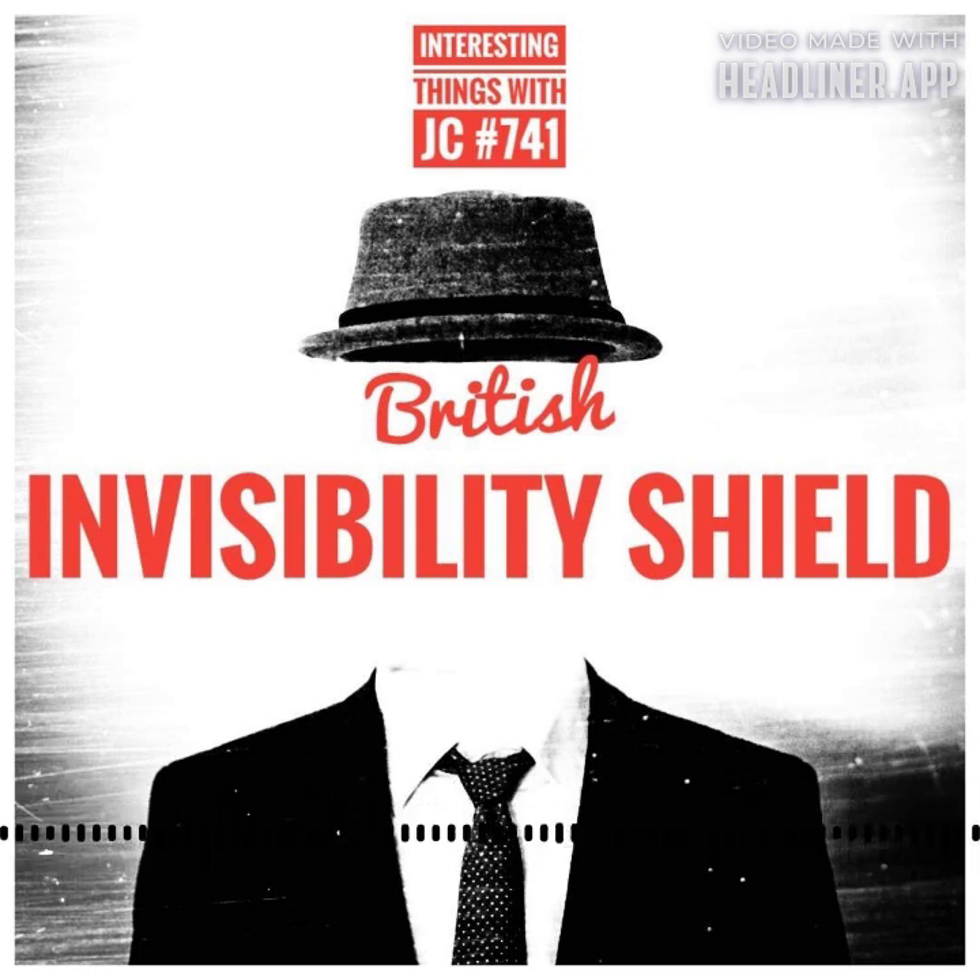This refracted light then spreads sideways across the shield surface, extending to the left and right. Because the lenses in this array are vertically aligned, the light reflected by a standing or crouching subject diffuses significantly as it travels horizontally through the back of the shield. Light coming from the background, on the other hand, is broader and much brighter. A significant amount of the background light refracts across the shield and towards the observer after passing through it. The backdrop light blurs horizontally across the front surface of the shield, effectively hiding the area where the subject would normally be visible.